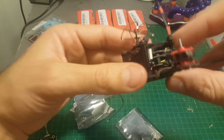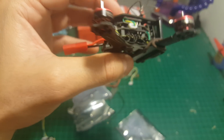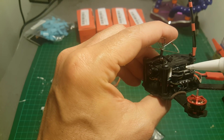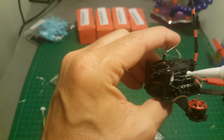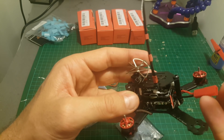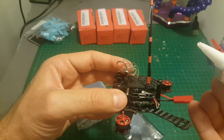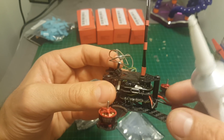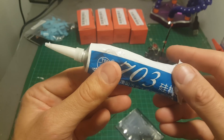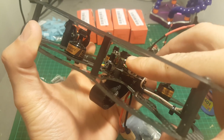You can see how I did it in my Bobo 95 build, so you can see how it's connected. I really recommend putting a little bit of silicone glue on top of the antenna connector. This silicone glue dries pretty fast and it's going to prevent the antenna from getting disconnected, losing signal, or damaging the board. It adds only a small weight. Let it dry for about 10 minutes and you're good to go. Unlike super glue, it can be removed, and after it dries it has a silicone-like texture.